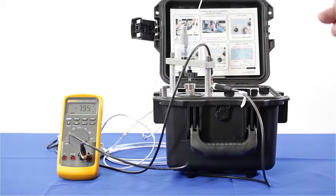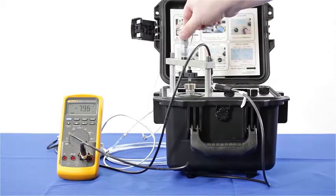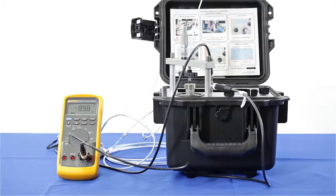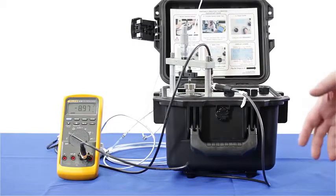What occurs is the technician may think that the proximity probe is installed incorrectly and actually change the distance of the probe tip from the center of the shaft — when this is not the problem at all. The problem has been caused by the incorrect cabling. So I can make my gap voltage look correct at negative 9 volts by moving the proximity probe a little bit further away from the target, but that's going to cause our dynamic output to change even more.